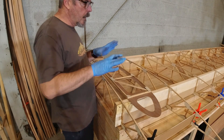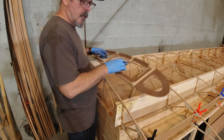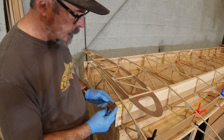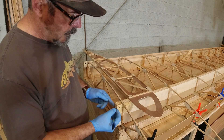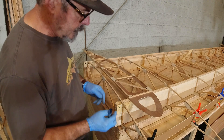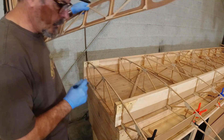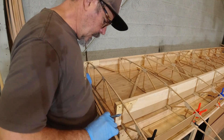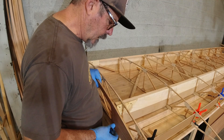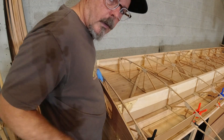That's all set up and the epoxy is setting. In the meantime, I'm going to take the root rib — because it has this additional eighth-inch and sixteenth-inch plywood in here, you actually have to remove some material over here so that it fits. I'm working on figuring out what that is. Since it fits good at the bottom — actually the sixteenth is planned for so you don't have to worry about that — but the eighth inch. So I just hooked it on the bottom there so I can kind of see where it's going.